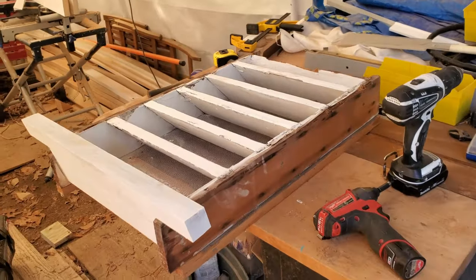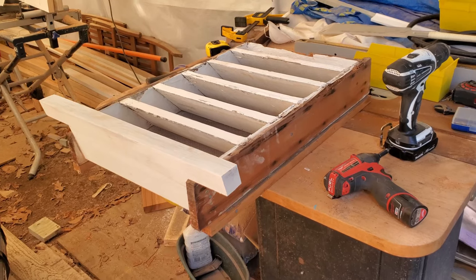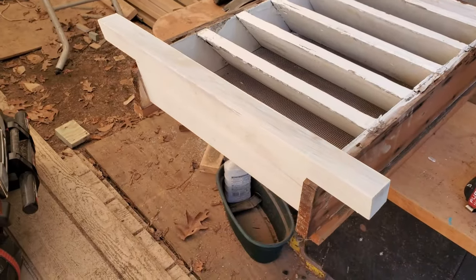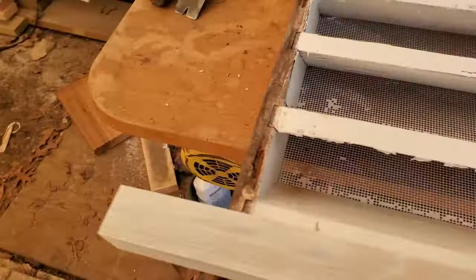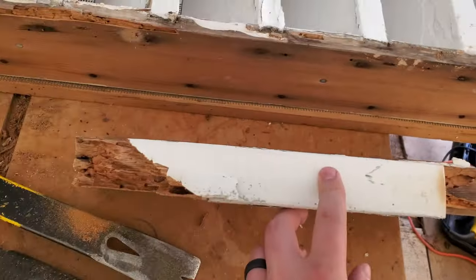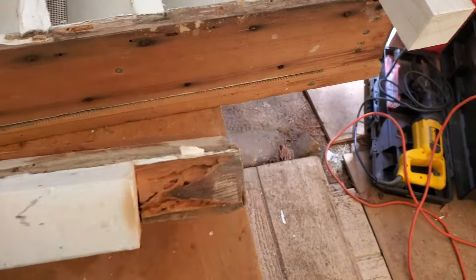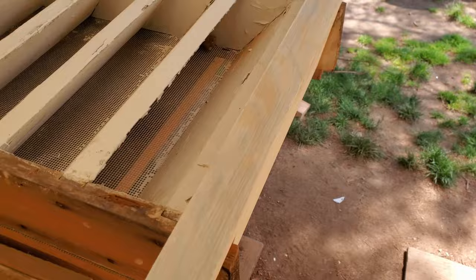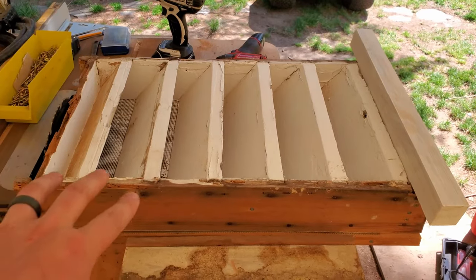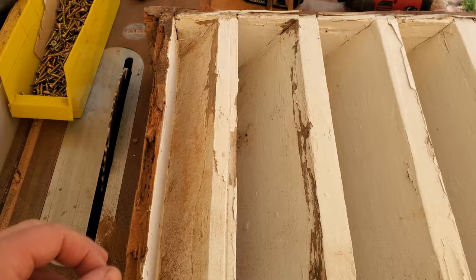I ended up deciding to just rebuild this gable vent. You can see here I actually built a new sill - kind of like how I did with that other window - using the same material: cedar. The old sill is all just destroyed. There were actually ants in here when I pulled it out. So that's all new. Next I'm going to basically assemble the trim as a picture frame and then screw it right to here. There's not a lot of meat left - some of this is pretty rotten - but I've got to work with it.